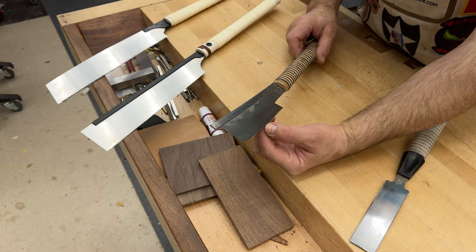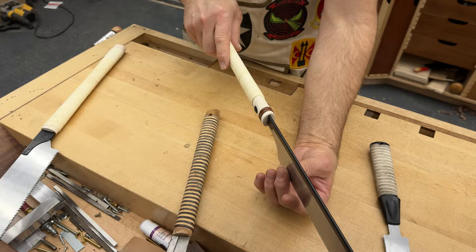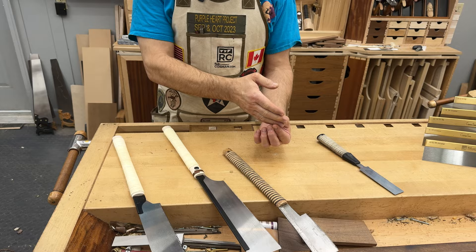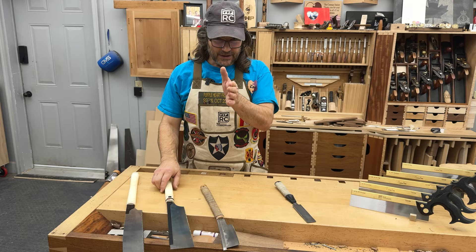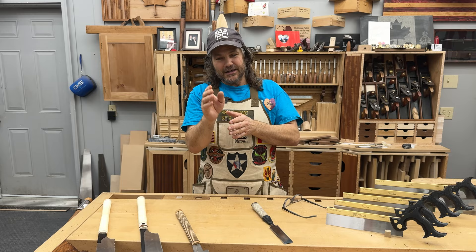Although that saw has been through a lot, the teeth didn't last very long. These are designed to cut on the pull stroke — when you place it in the wood, it only cuts in this direction. The idea is you can get a very thin blade; if you take a blade of grass, you can pull it between your fingers but you can't push it. What I found was on western hardwoods, that little thin blade had a tendency to wander and follow the path of least resistance, so instead of a nice straight cut with a flat surface, the blade would wander.